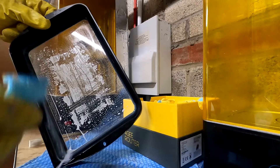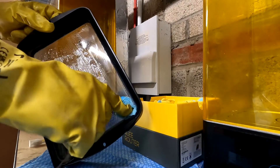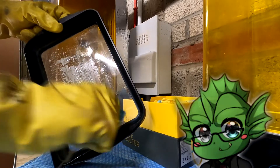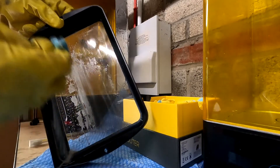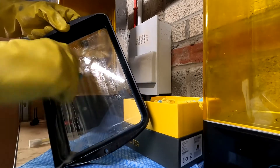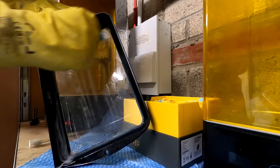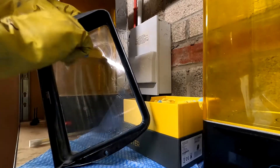Number two: you don't need to use IPA when cleaning up the FEP sheet. In fact, when you do use IPA, what you'll notice is it clouds up the FEP to all hell, making it slightly worse each time. I instead opt for a method I learned from Slice Print Roleplay here on YouTube, where you get a simple microfiber towel, cut it up into small chunks — he reckons you can do it in about three of them, I always end up using more — but you just gradually wipe down the FEP until it's clear and clean. No IPA needed and you don't fog up the FEP sheet.